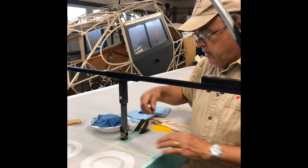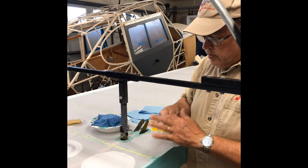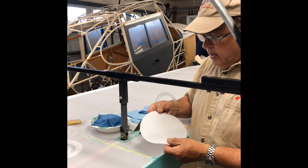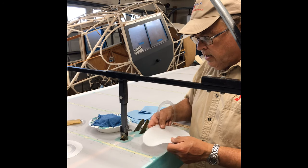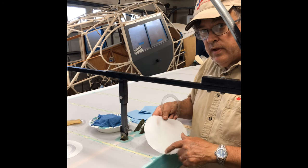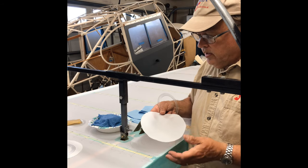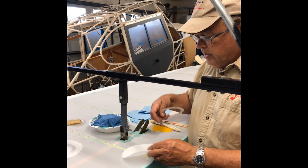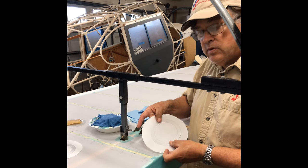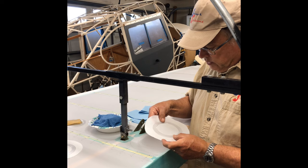I've already done that on my inspection ring — it's been sanded, all nice and smooth, with the bump from the forming tree removed, so this one's ready to go. I've cut my doily. Since we're not heat shrinking these on, make sure your doily is cut from a piece of fabric that doesn't have any wrinkles. If it's got a big fold across the middle, that fold will likely still be visible when the inspection ring is all done. The doily is one inch larger than the inspection ring itself, which is correct for our system.